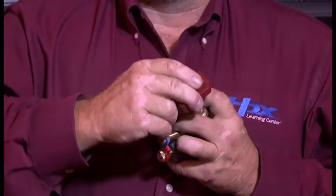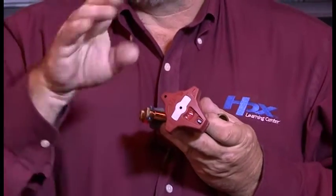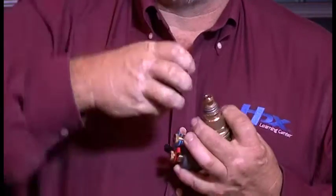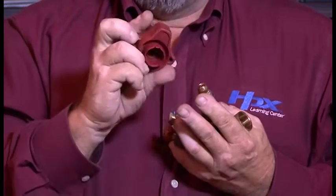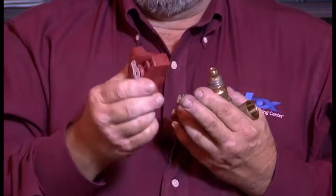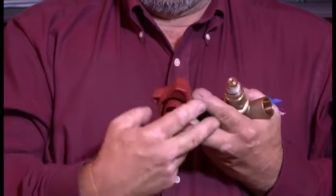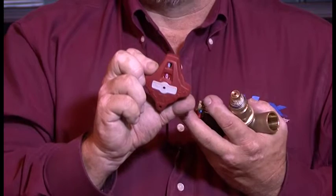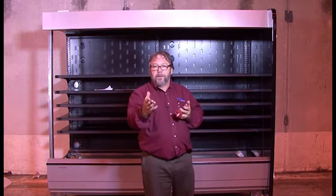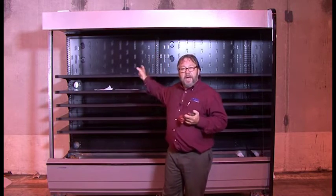First thing we want to do is close the valve all the way. What we should see is zero, zero. If we don't see zero, zero, then we have to reach over and pull the top of the valve off. On the inside of the valve, we can see some serrated teeth. We're going to rotate these numbers until they equal zero, zero. Now when we go ahead and set the flow rate and get the proper GPMs, we know those valves will properly correlate to our hand wheel.